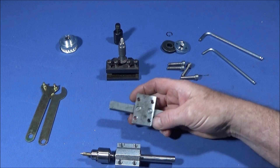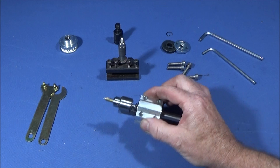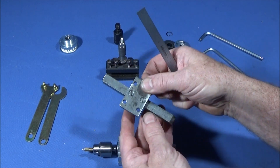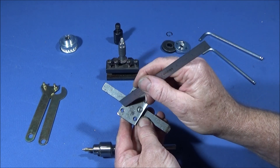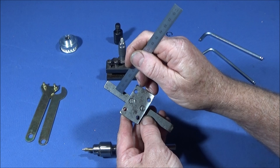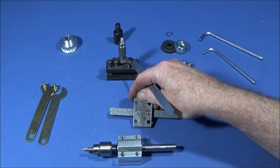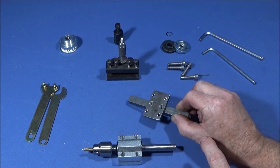I did the other punch marks with the transfer punch so I could screw it on nice and square, hold it tight, and get all the other punch marks in exactly the right place. This piece of steel is only about 30 millimeters wide. I put four BA through holes dead center — equal both sides, dead center to the screws — then put that onto a piece of 10 millimeter square bar. I marked up the center, used a transfer punch through those holes to get the positions dead right, then drilled through the square bar and tapped it for four BA, and used four BA countersunk screws in those countersunk holes.